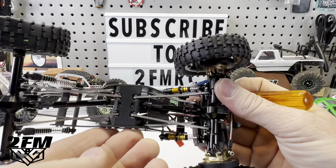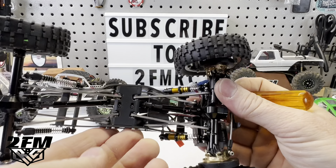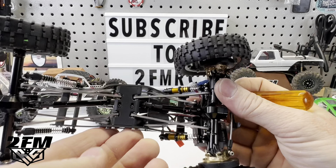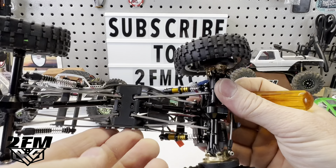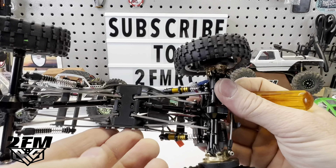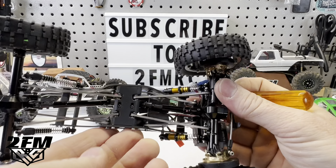A Hard Park skid comes with this kit. The only issue I really had with this kit at all is these little inserts that go inside some of the 3D printed parts — all of the ones on the skid were coming out on me. When you screw into them, they just pull out of the plastic. So you may want to make sure and put some glue on those things or check them. All of mine came out of these, so I glued those. Definitely check that.